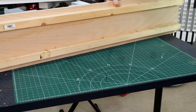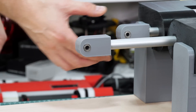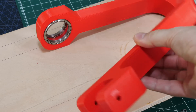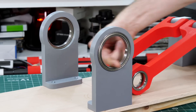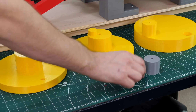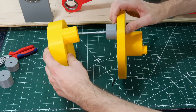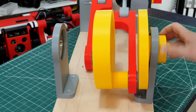I've made this wooden base with some batons on the bottom to hold it flat and some 3D printed brackets to hold the cylinders. My pistons have got blocks on the end with some bearings — thanks to Simply Bearings for the bearings for this project, check out simplybearings.co.uk. My piston rods have got some low profile bearings in the end, one in each side just like a skateboard wheel, and on the other side there's a bolt which fits into the bearings on the piston rods so it can make that kind of motion. The crankshaft is going to be mounted in these massive bearings. This flywheel and crankshaft is made of multiple pieces — three big wheels and little stubs that fit in between, all fitting onto some M6 studding with nuts each side holding the whole thing together in tension. There's half the crankshaft together for one of those cylinders, and you might see the little stub on the outside for the air valve.